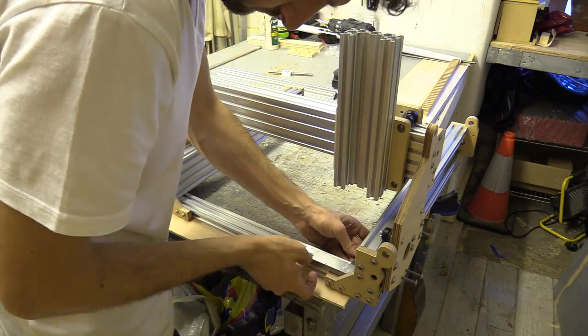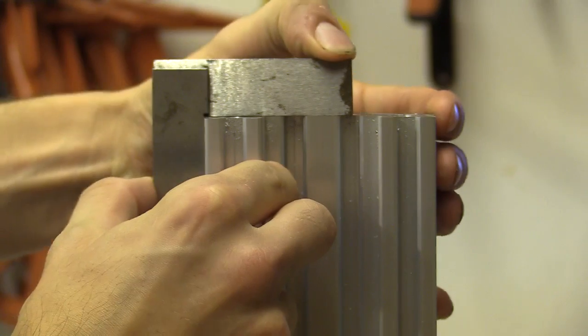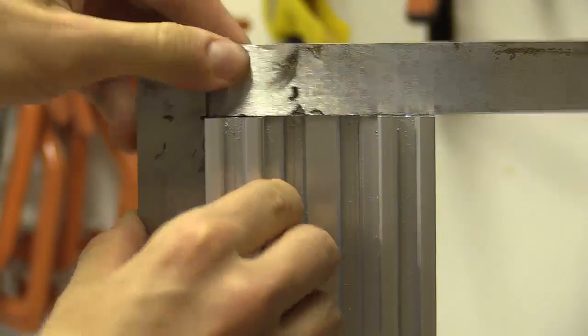It is more likely that the plates might have warped a little or the C-beam was cut a little off. There's not much I can do about the plates as they are birch ply. But while checking the C-beam, which was fine along the long edge, I noticed it was a tiny bit off along the short.